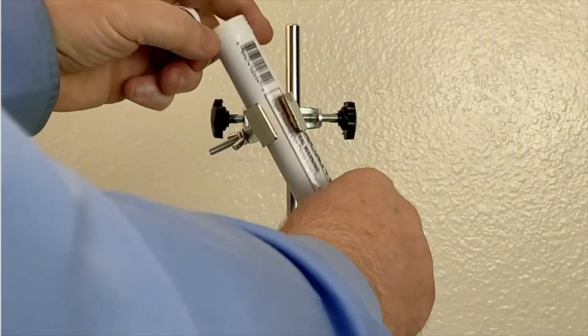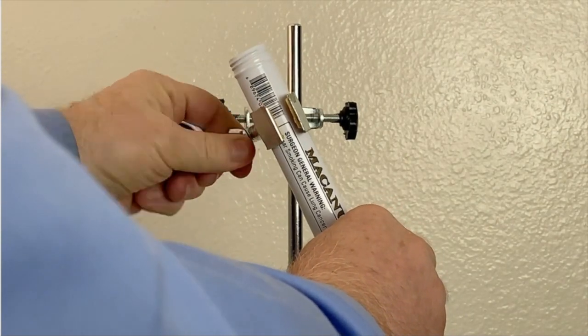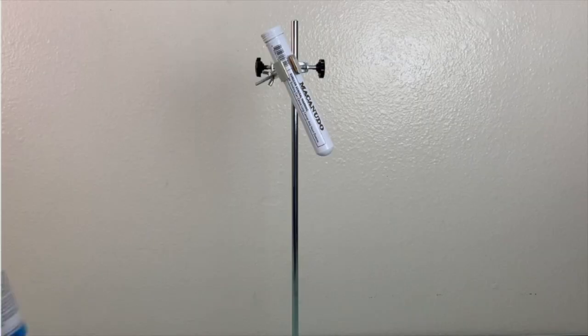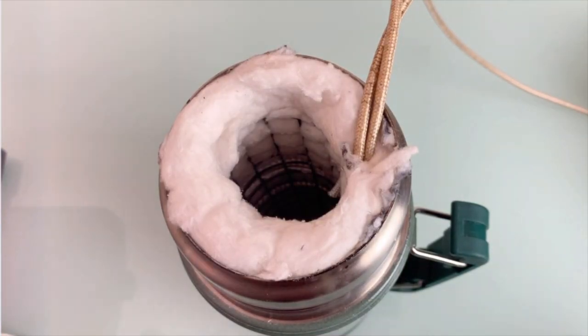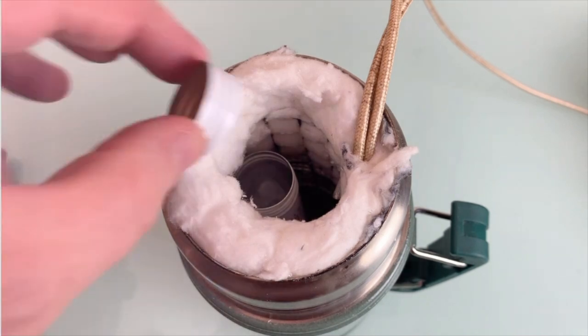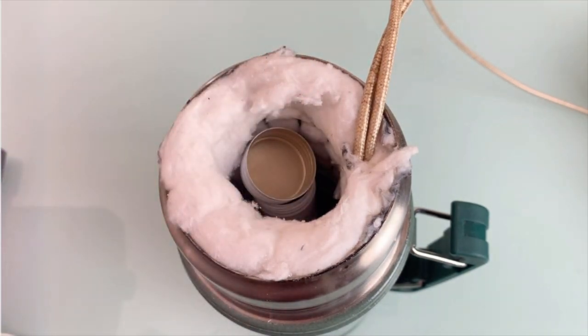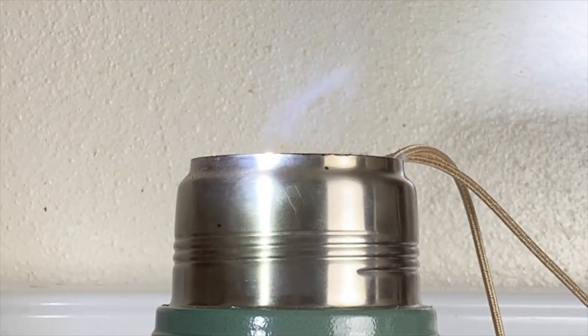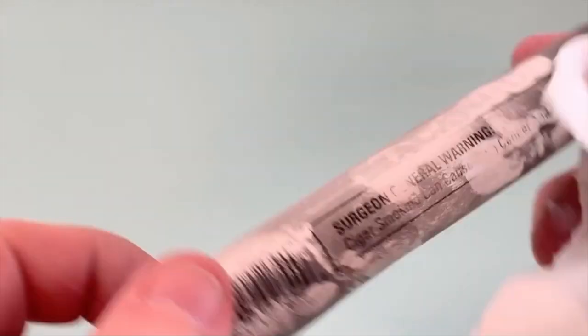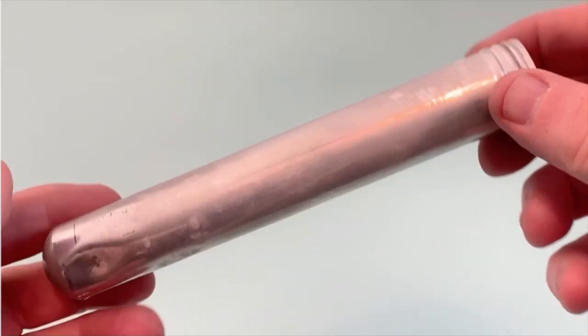Of course, you don't need to use a micro-kiln for this experiment — you could just clamp the cigar tube to a ring stand, rest the screw cap loosely on top, and apply heat with a handheld torch. But I like to do things in a more controlled fashion. First, we need to remove the paint, and the easiest way to do that is to bake it out in our micro-kiln. Just drop the cigar tube into the kiln, set the set point to 450 degrees C, and place it in a well-ventilated area for about 30 minutes. The residue that remains on the surface can be removed with a careful application of a little friction using a few paper towels, or a buffing wheel if you happen to have one.